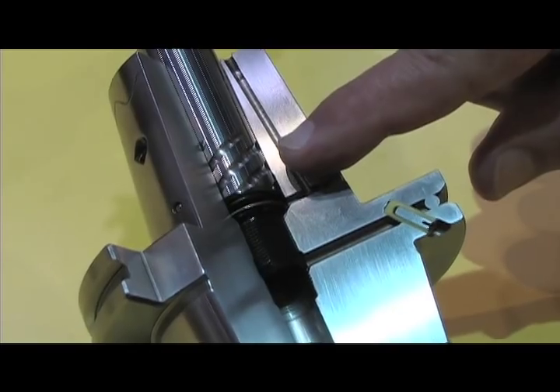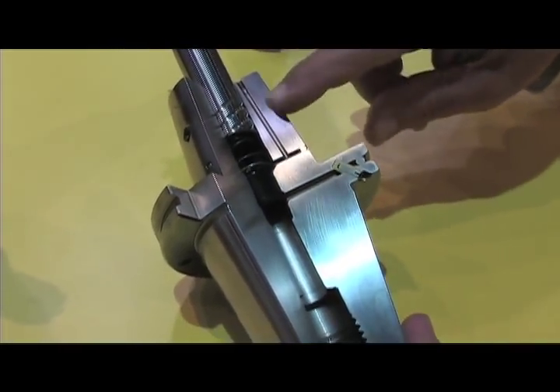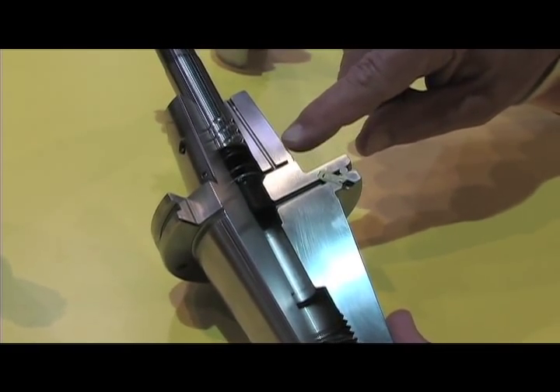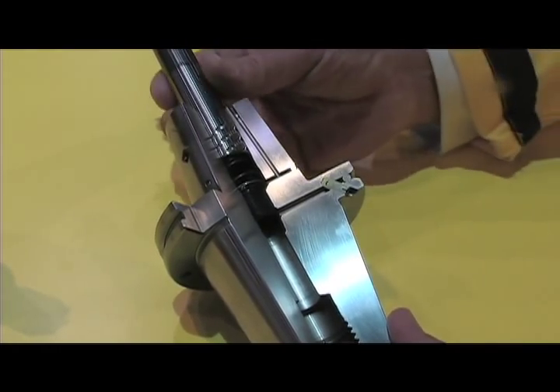What are some of the other features and benefits? We're targeting this program to titanium type milling — titanium in airframe components where the milling operations are a little more demanding, where the tool pulling out would be catastrophic. So this is a more secure holding system when you're doing shrink fit.